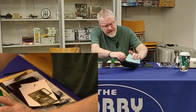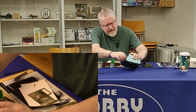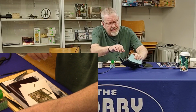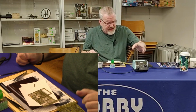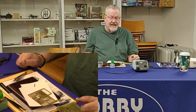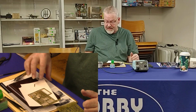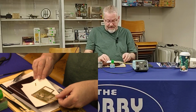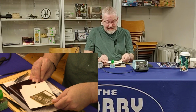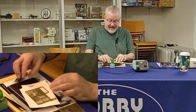Normally I set my iron at anywhere from 600 to 700. I'm finding it's kind of slow now, so I'm going to go up to 750. Which raises a point, one of the big concerns people have about soldering is thinking that you're going to burn yourself or hurt yourself. And as long as you're careful with the stuff, it's probably not going to happen. And to be honest, even if it does, it's not as lasting or as painful an injury as a number 11 cut, which we've all done.